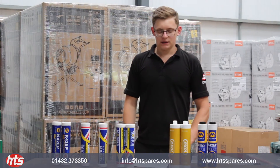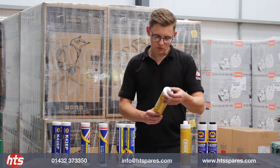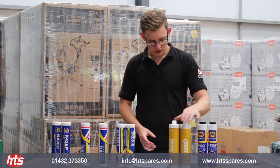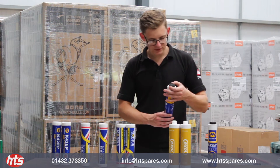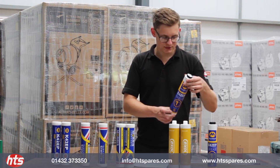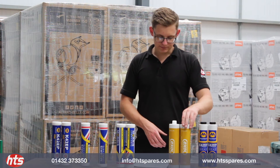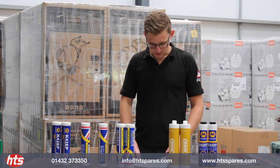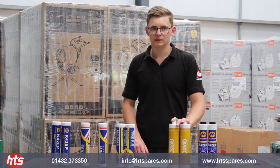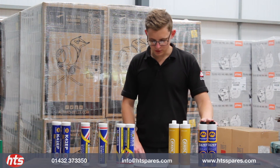So what's the difference between the Rayner and the Lube Shuttle? The Rayner has a 20mm thread on the end and is a 500 gram cartridge, whereas the Lube Shuttle has a 33mm wide thread and is 400 grams. Both work in the same way and both can be put in double-handed grease guns which offer higher pressure. We do guns to suit both — a genuine Rayner and a non-genuine Rayner gun, and also the appropriate guns for the Lube Shuttle.